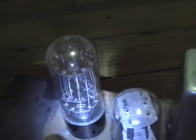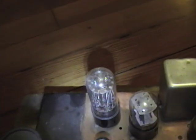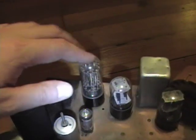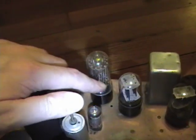Ballast tubes kind of look like vacuum tubes. Here's the one in this set — you can see there's wire inside, kind of like tungsten wire in an incandescent light bulb. It has higher resistance than regular copper wire and all it does is dissipate heat, burning off the excess voltage because they didn't have enough tubes to use it up and there weren't tubes available like a 35L6 or 25L7 to get the right combination of voltages. So they just chose to burn it off with this.